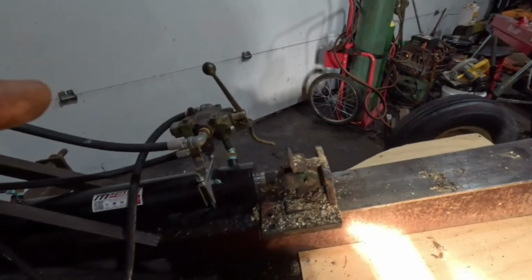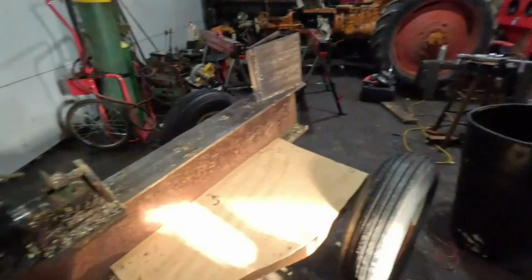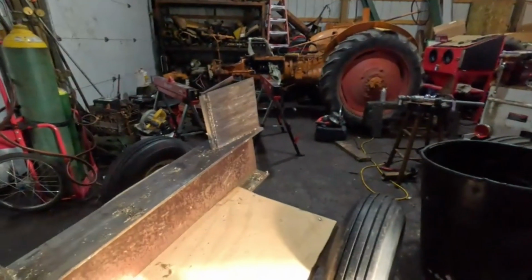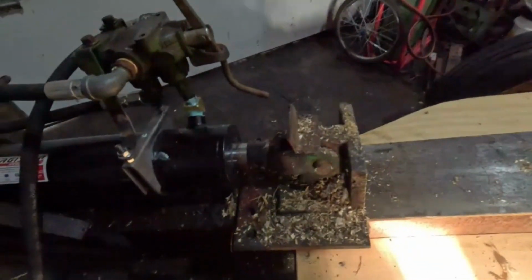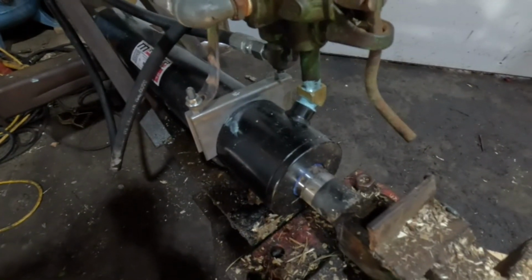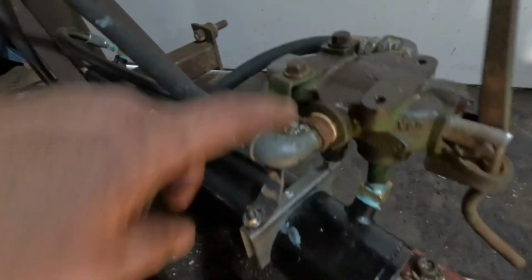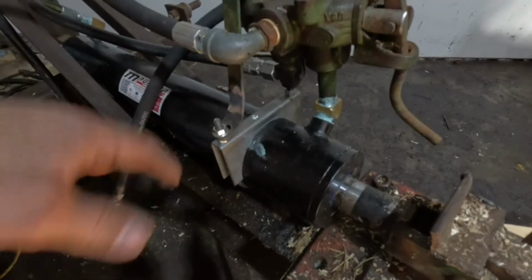I did shore up, we'll call it, my log splitter. So for what I wanted to do to this thing, it is done completely, 100%. Yay! So what I did, my brainstorm was, I got a muffler clamp, and got another set of nuts to go on there. So it's clamped to the cylinder. But then I used the same little brackets that were on this thing, just heated them up and bent them back, then bent them again, and so there's one on each side. So that should work pretty good.